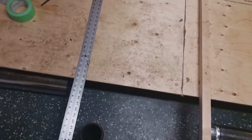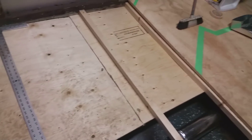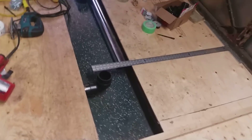What I'm actually up to right now is I've figured out where my bathroom vent goes, which is right in this area here. I'm getting ready to cut the hole for the ducting from the bay side. I got started on that during the week but my hole saw was so dull all it did was take the paint off, so I had to go get another one.